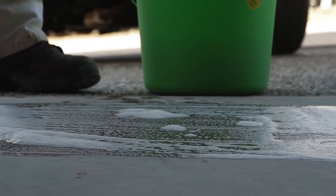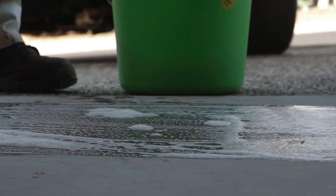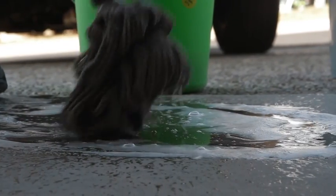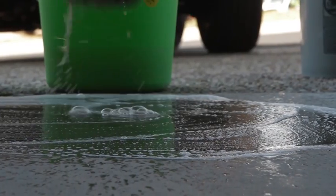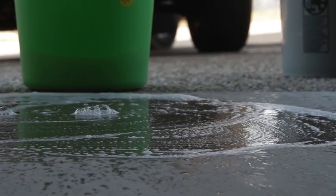When the cleaning cycle is finished, rinse the surface thoroughly with ample amounts of clean water to remove all traces of contamination and residual cleaning solution. If necessary, repeat until the surface is absolutely clean and ready to be prepped. Beyond oil or grease contamination, if the floor has been treated with any kind of waxy or silicone-based sealer after it was poured, no paint will stick to it.